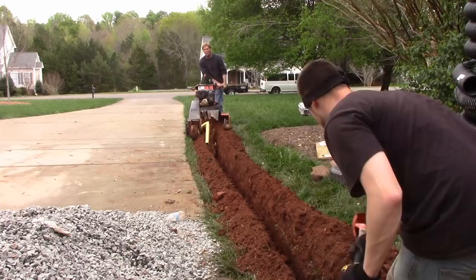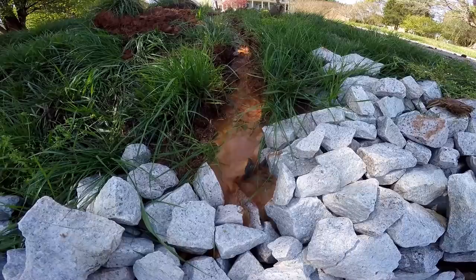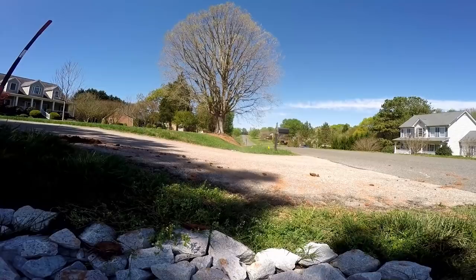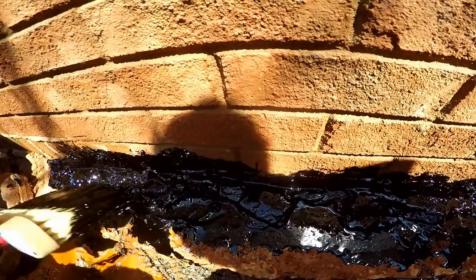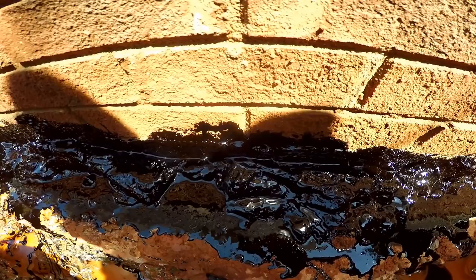Here's what it looks like before you install your pipe. We're cleaning off the footer, running water on the foundation — water is just pouring out. We've got tremendous fall; discharge to daylight goes into riprap, basically disappears, and ends up inside a culvert pipe that drops off dramatically down to a major storm drain about three houses down. We're putting on our liquid rubber — you can see how thick it is. It fills up the voids right along the seam where the foundation wall meets the footer, which is where water comes into the foundation.